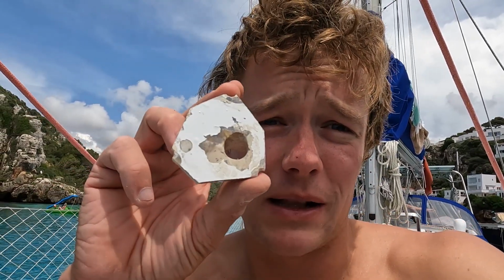What we're going to have to do now is just let it dry out for a couple days. And I think I'll probably treat it with some white vinegar, which is a really powerful antifungal. Pour some white vinegar into the hole, let it soak into the wood, and then let it dry out again, bone dry. Give it a good few days, as long as we can really, and then I can fill it full of epoxy and maybe some wood as well to fill in some of the voids. And yeah, then I can replace the little fiberglass skin that I've cut off.